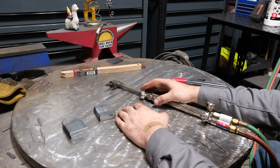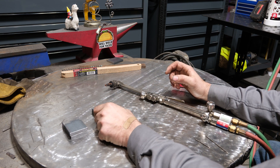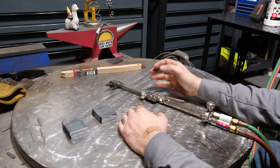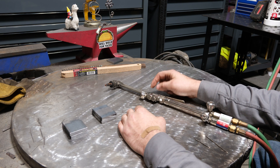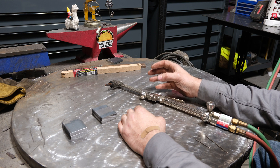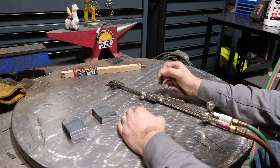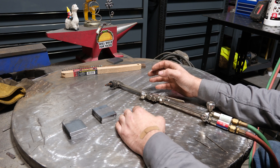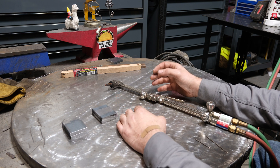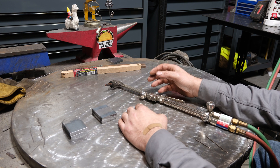In a previous video I did test welds of 7018 on a flat plate and also did fillet welds to determine if preheating affects penetration — link in the description. The gist is that actual depth of penetration isn't going to change much with preheat, and it's not really wise to heat something really hot in an attempt to use an underpowered welder to gain fusion. It just doesn't work.